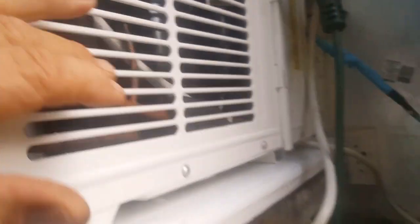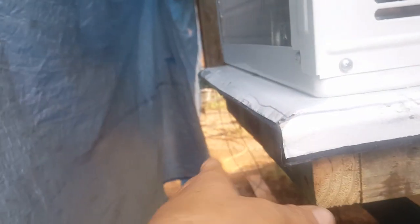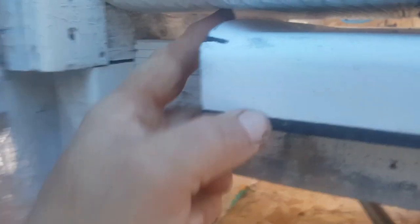We use the sign board to build this waterproof tray — the water drips off the edges here. We just heated it up with a heat gun, put it between a couple of boards, and bent it over. We'll cover that with epoxy, just like a garage floor, for aesthetic purposes — it's never going to rot. The front lip is turned up so that no water goes forward onto the garage floor, and everything is angled back away from the house about a quarter bubble.